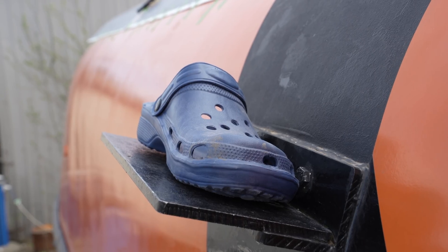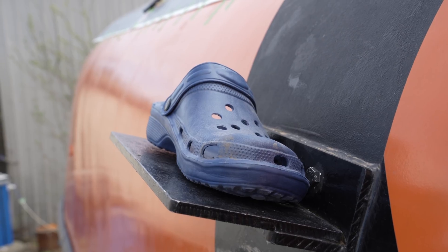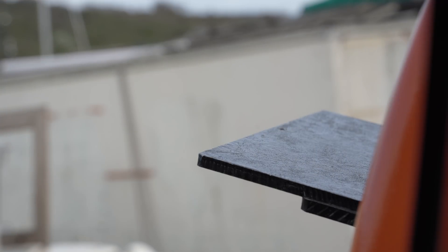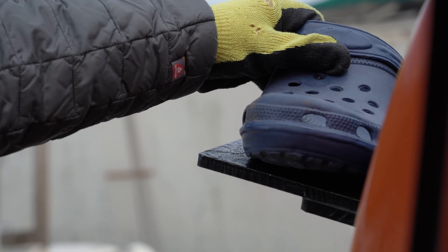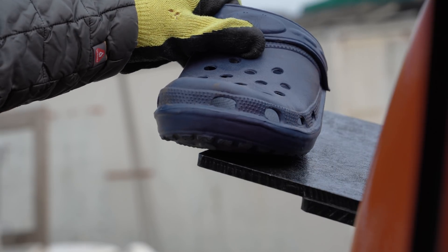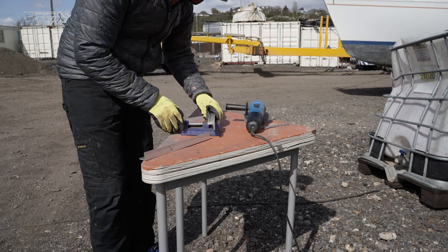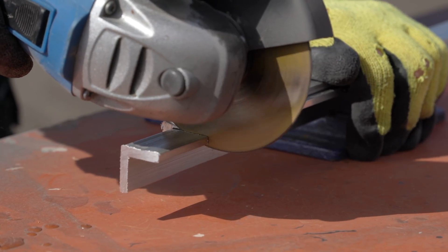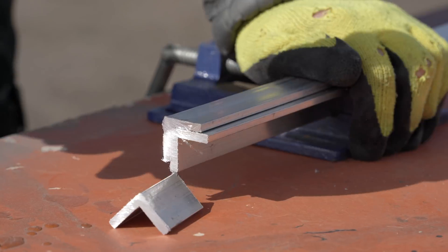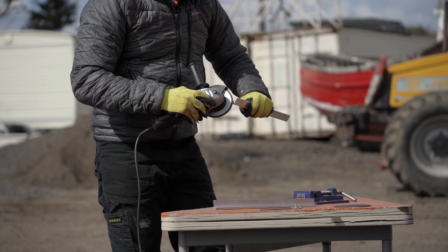Right, let's leave that alone for a moment and go back to the croc. At least one of you was concerned for my survival regarding the main set of hatch-to-deck steps. They have plenty of anti-slip surface applied, but no edging. I've had no issues so far, but point taken. I've decided to solve the great conundrum of the falling croc - it's not going to be spectacularly complex. I'm going to add some robust angle to the outer edges. This will stop side slippage but not allow any pooling of water. I've gone with aluminium again, same as the steps, and any galvanic corrosion effect with the small bolts should be minimal.